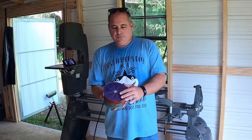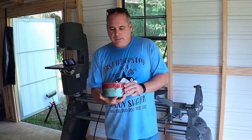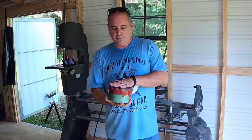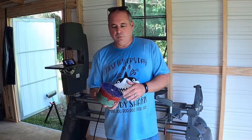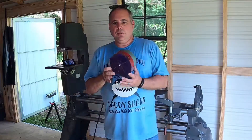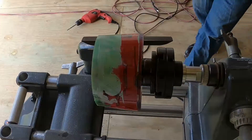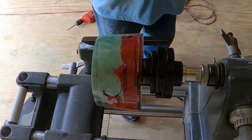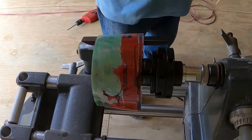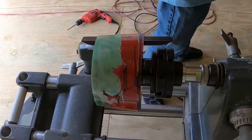You'll see this purple section on the top — that was basically just a leveling pour. I had some leftover resin, so to level off the top and give us a good starting place, I just did a leveling pour. We're going to mount it up on the worm screw and get it on the lathe. We're not going to use the speed reducer on this one because I don't think it's needed, so we'll start off at about 700 RPMs, get it trued up, and go from there.